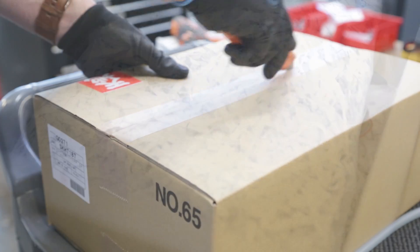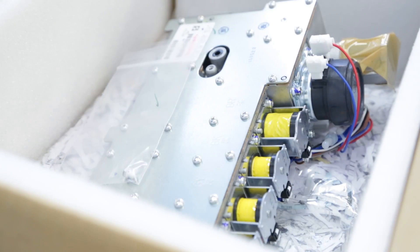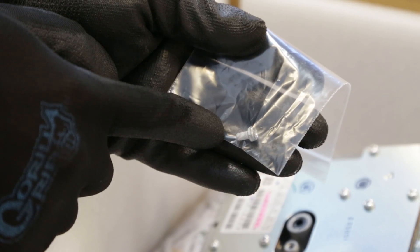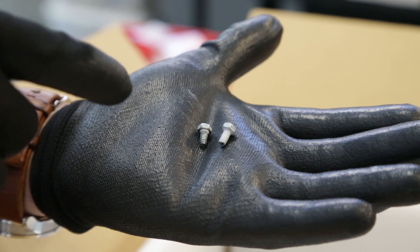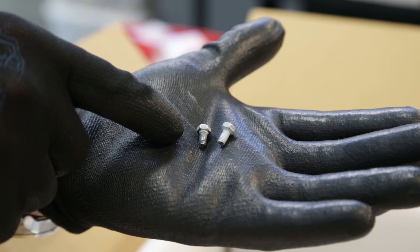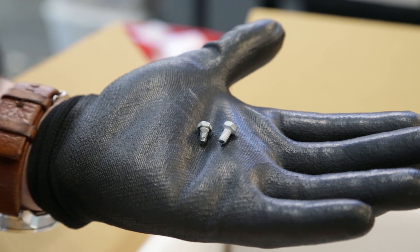Open the box of new parts and remove packing material to reveal the new manifold plate. Locate the new pre-coated screw, but don't install it yet. Note: the old screw should look like the Teflon has been removed, and the new screw should be completely coated for a gas-tight seal.